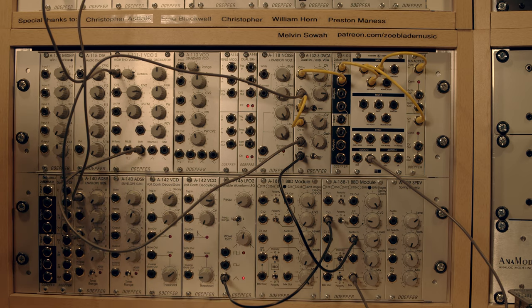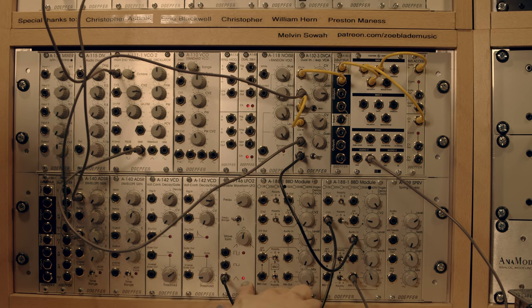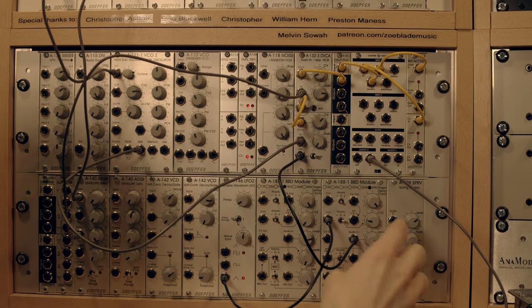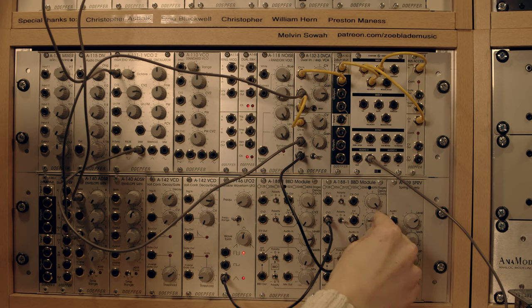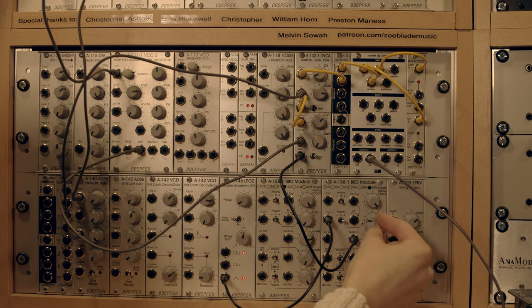but you might be interested to know that when you've got a chorus phaser flanger type guitar pedal, it's got a little LFO inside, I'm guessing triangle, which then connects to the clock of whatever's delaying the signal, in the case of the old ones, BBD, and that's how you get this kind of a sound. And if you can change how much the delay time is changed by the LFO, then you've got a knob like this one on the pedal.